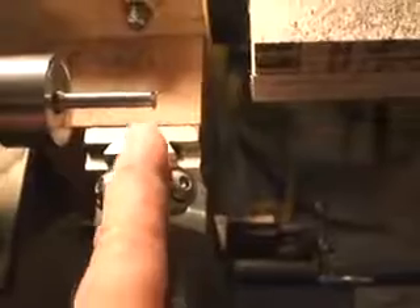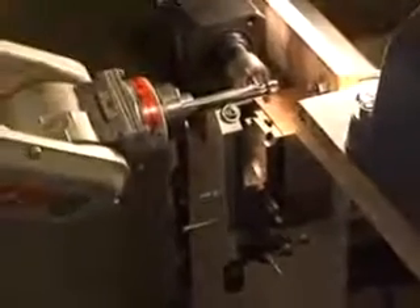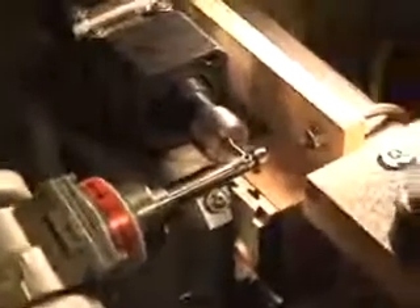There's a little standoff here. The standoff has two ball bearings on it, and the shaft of the cutter rides in these ball bearings. The steady rest is mounted on the lathe cross slide — you can kind of see it down there below the steady rest. I use that to get the bearings and the alignment everything just right.